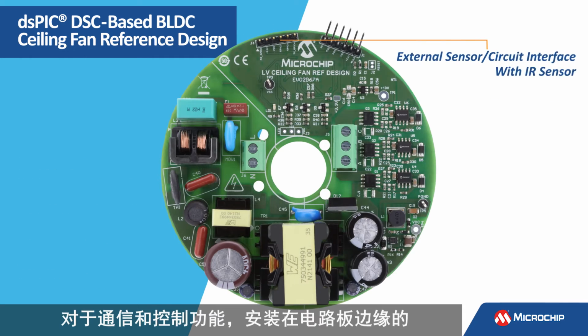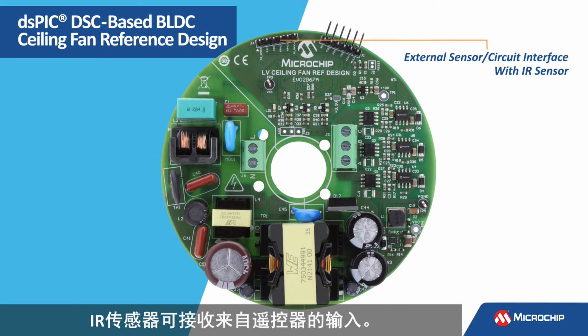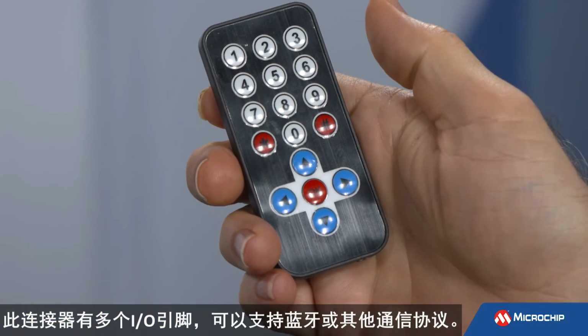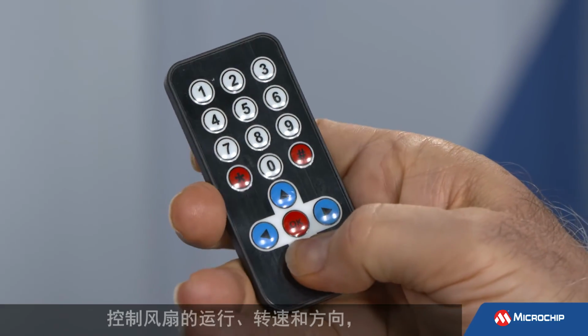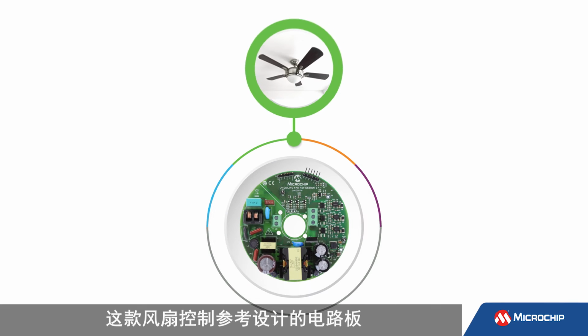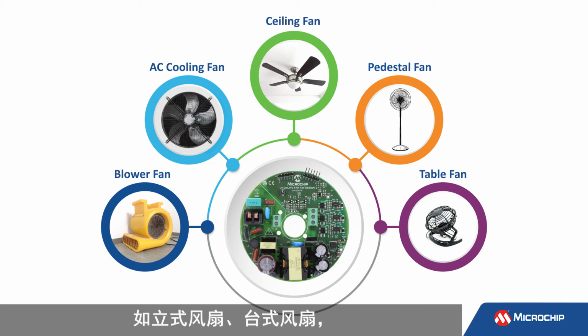For communications and control, an IR sensor mounted at the edge of the board receives inputs from a remote control. This connector has several I/O pins that can support Bluetooth or other communication protocols. In our demo, we control the fan operation, speed, and direction using a low-cost IR remote control device, which transmits commands picked up by the IR sensor on the board. This fan reference design board can be used to spin any type of low-voltage 3-phase motor-based fan, such as a pedestal or desktop fan, or even the cooling fan in an air conditioner condenser.